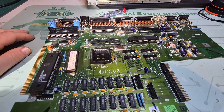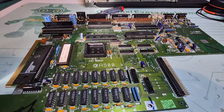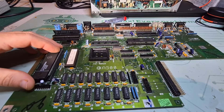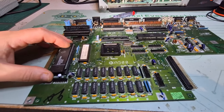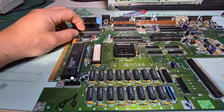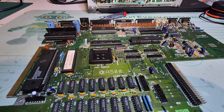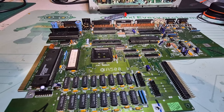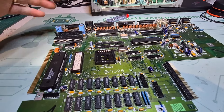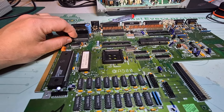This is the next IC — look at these two guys. One might be bendable back. This one has been cut and damaged, but we can solder a little leg to that and see if we can get it working again. All legs are here otherwise. Two legs to straighten on Gary and one leg to just complete. What we can use is a little leg from another IC — I have a pile of broken ICs and I've kept some of the legs to just solder on top.